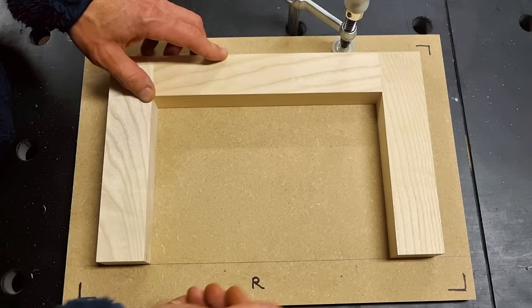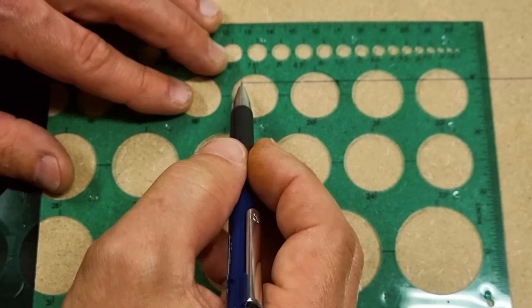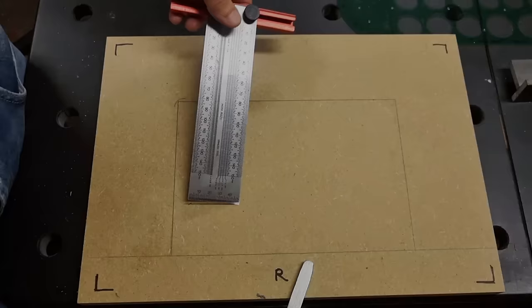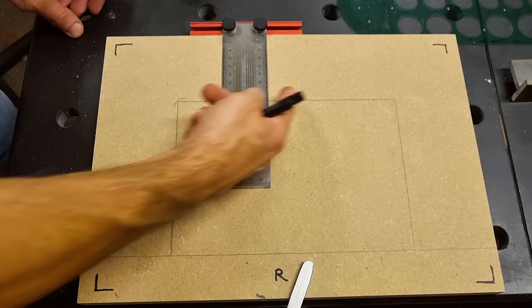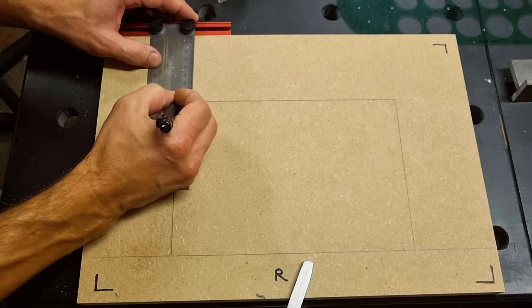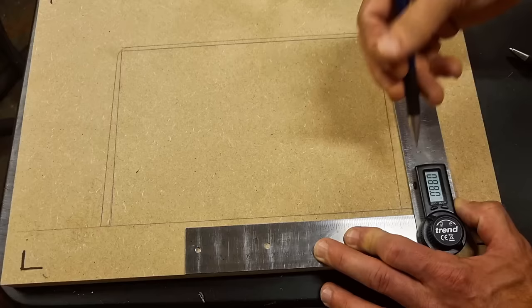I start the layout by setting a baseline where the bottom of the legs should be, eyeballing the dimension and making a line using the reference edge. I make the same baseline on the back side of the template too. I eyeball-center the workpiece left to right on the line and mark the inside edges. The final routing will use a 19mm router bit, so I place a 19mm circle in the inner corner, leaving some margin, and mark an arc. I then extend all three lines edge to edge and lay out the tapered sides at two degrees using the reference edge and a protractor.